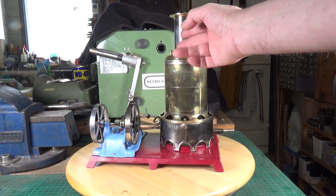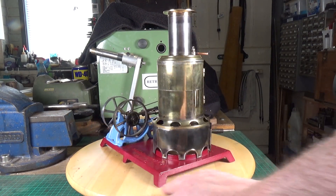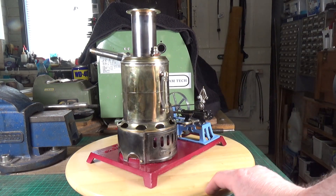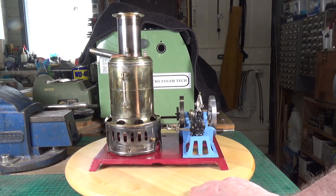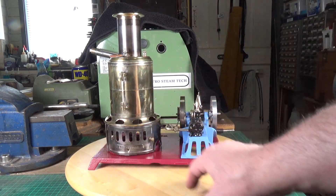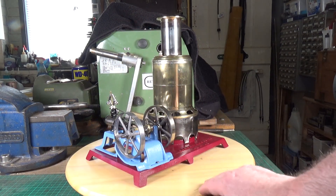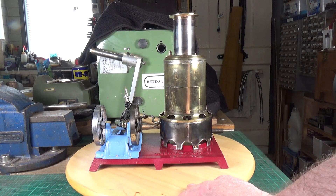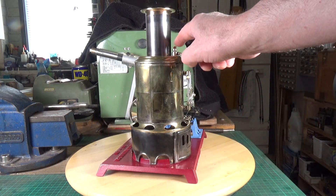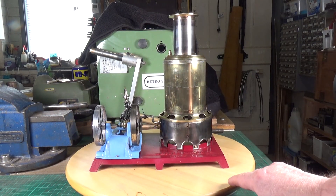I spent yesterday making the smokestack and chimney cap for the Weedon 49, and it's turned out okay — actually not too bad at all. The bluing on the stainless steel tube for the main chimney stack is simply created using heat and engine oil. You heat it up until it's about a dull red colour and then quench it in engine oil, and you get quite a nice blue finish to the smokestack. So really we're just left now with the burner, which I've got to make a new one, and a little whistle top. But other than that, the Weedon 49 is very nearly finished.